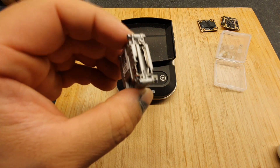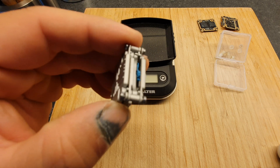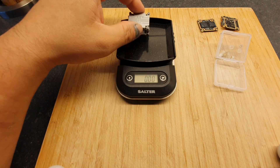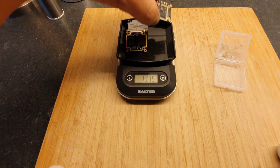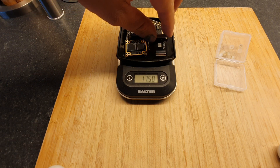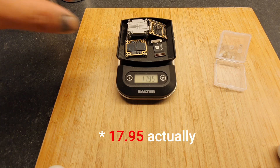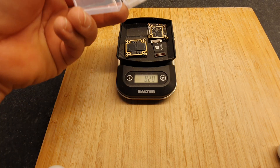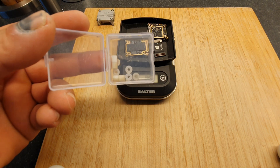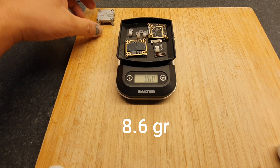I've already put the case back together again with all of the screws and the retainers — it even has the thermal paste inside it. The heatsink by itself for the case weighs — wow — that's 9.75 grams, that's quite a lot. With the two PCBs and the ribbon cable we got 17.8 grams roughly. So we're gonna take away the heatsink, and I'm gonna need some spacers and a few rubber washers to mount it — adding those, that's a total weight of 8.6 grams.